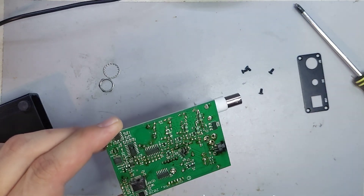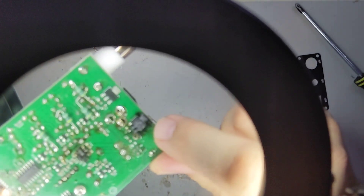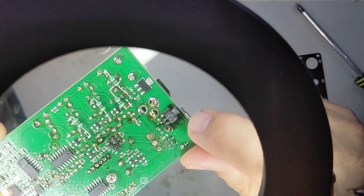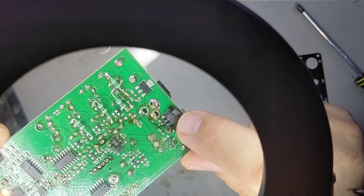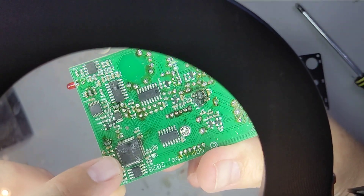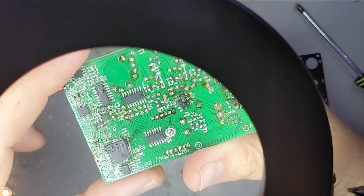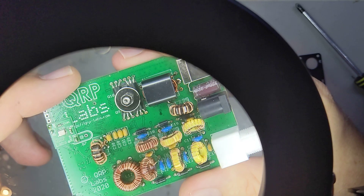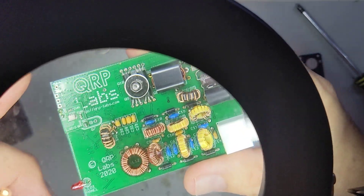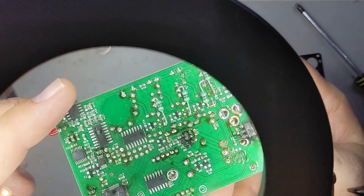Oh no. I don't know if you can spot that immediately, but that is a lot of burnage around — I think this is the 3.3-volt voltage regulator — and it appears to have sent 14 volts all the way to the microcontroller and through here as well. That's burned. This is burned. That's burned. Yeah, some burnage going on here. Everything up top is beautiful, and that's good, so I'll definitely salvage the inductors and the TCXO and stuff like that. But down here below we have some major carnage.